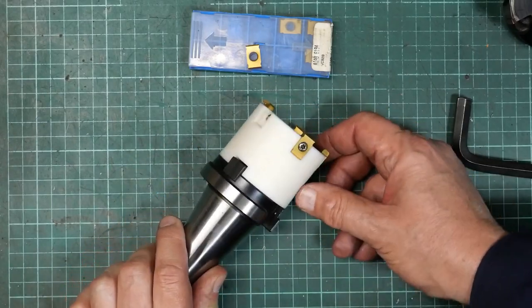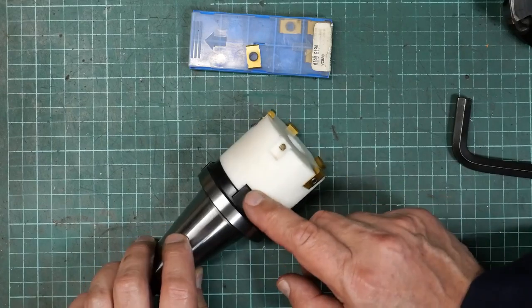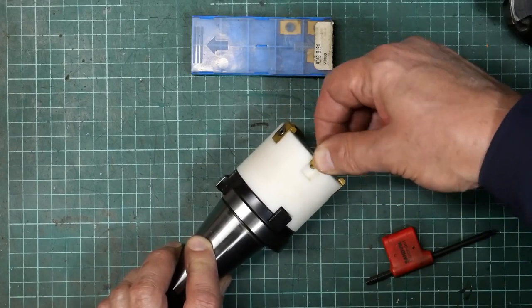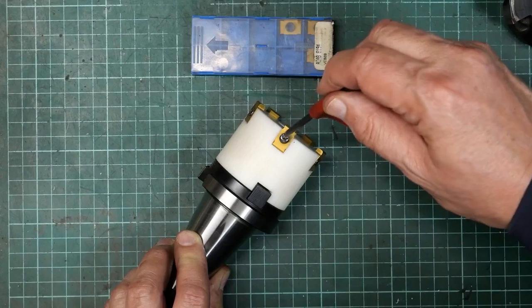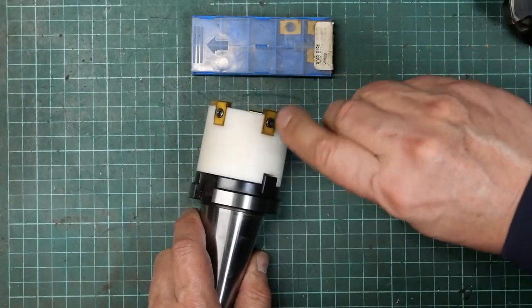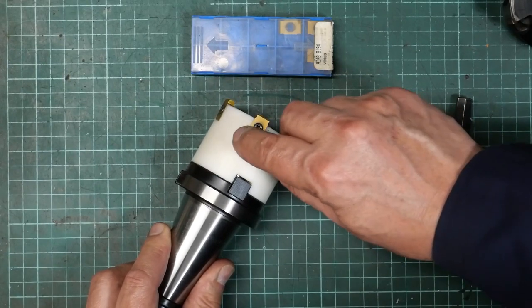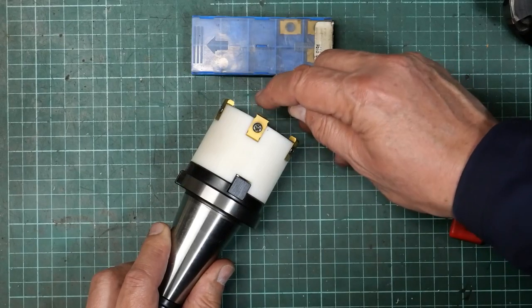Now, most of the machining that's going to be required to make this would be quite easy. It's pretty simple, straight turning, I guess, and then a bit of milling for this slot. But these pockets are the thing. These inserts, in my prototype here, and following advice from the Practical Machinist forum, these pockets are set at an angle to give clearance for the insert. You won't be able to tell here, but the top of the pocket is inclined in the direction of the cut, so that makes this cutting edge come into contact with the work first, and the trailing edge will have a slight clearance.